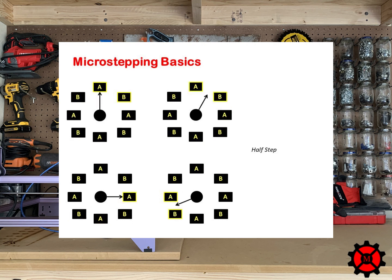This diagram shows the half step, which is a combination of one-phase and two-phase on full step modes. This results in half the basic step angle and provides smoother operation, but with 15% less torque. You can eliminate this torque decrease by increasing the current applied to the motor.